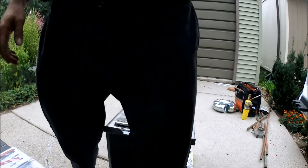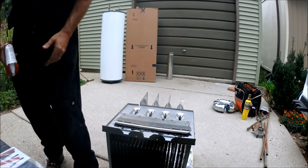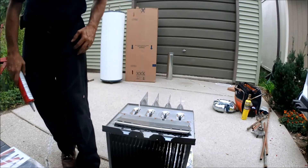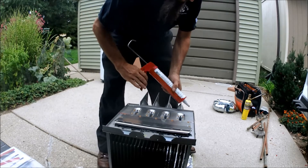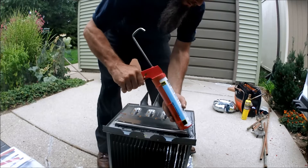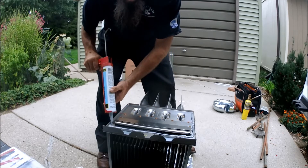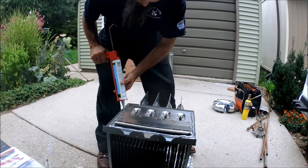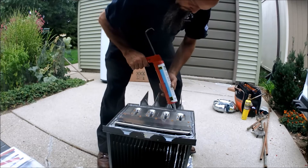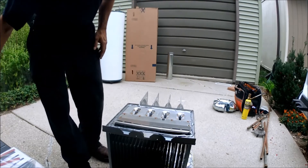Now I've got to get my coupling box on. Using just regular silicone — it's good up to 400 Fahrenheit, and I know I'm not running 400 Fahrenheit in here. I've used this for years and I've never had the caulk fail on me. If you give me a comment saying I need to use high-temperature caulk, I'll disagree with you and tell you I've been doing this for 20 years.